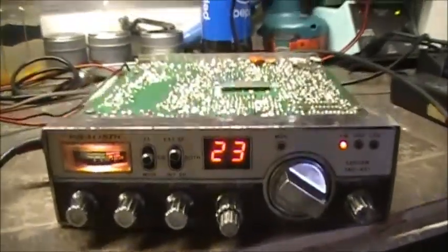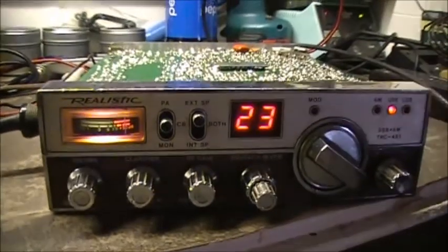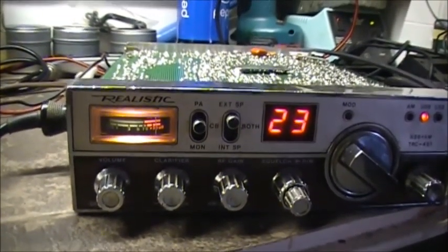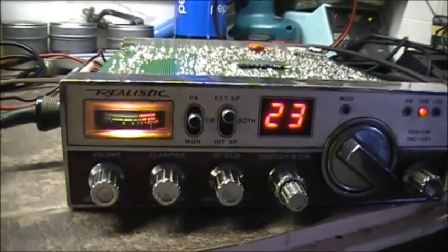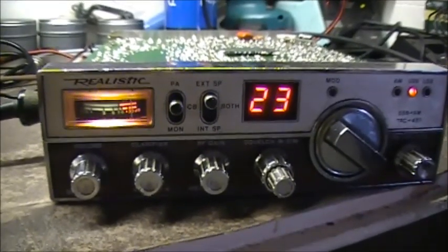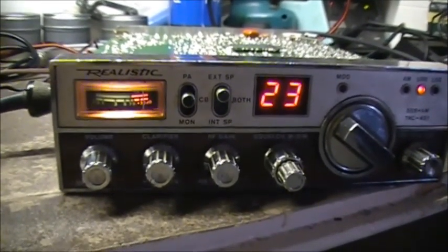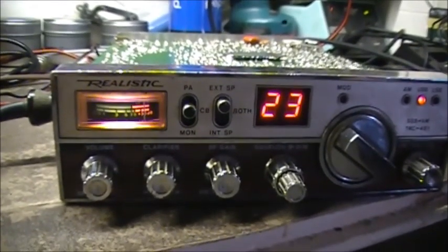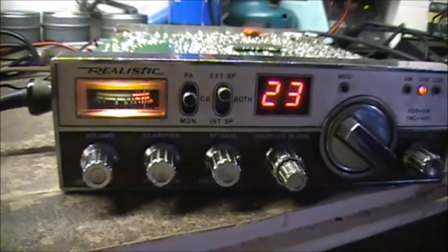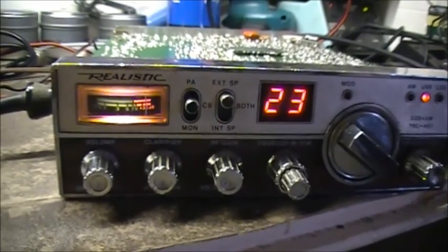Receiver on this 451 is not very good at all. I'm going to put her on sideband, as you can see, much better. AGC kicked out. Getting a pop in at about 1 uV. I can start hearing that tone at about 0.250 uV.